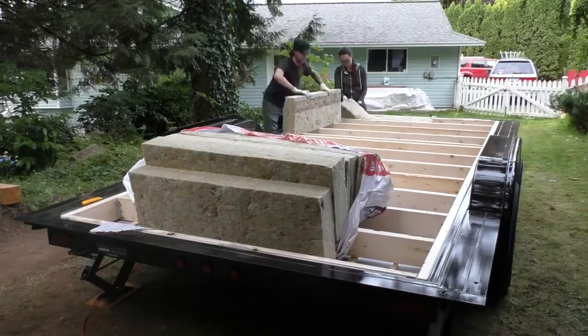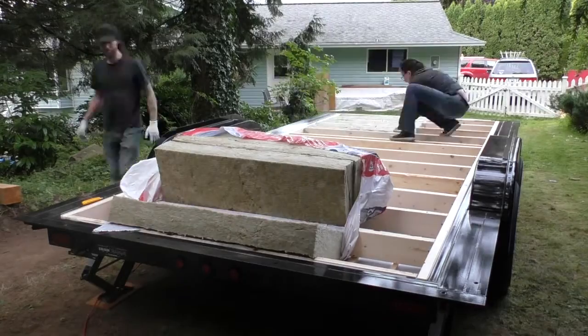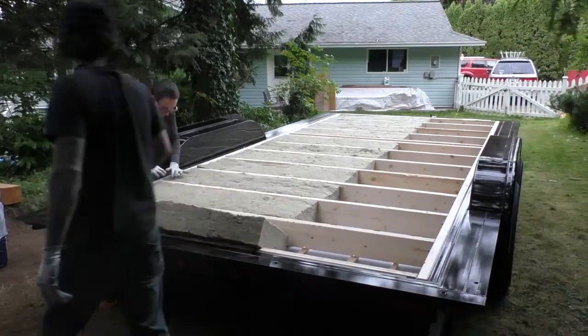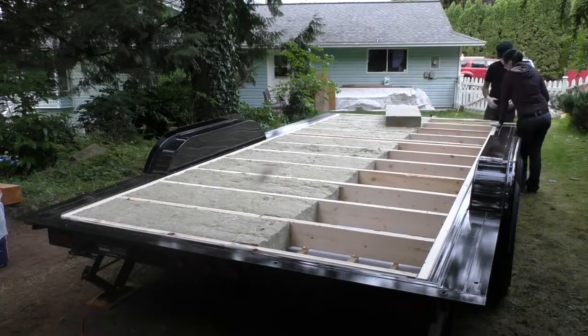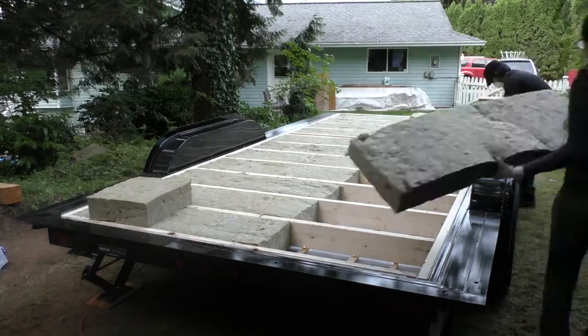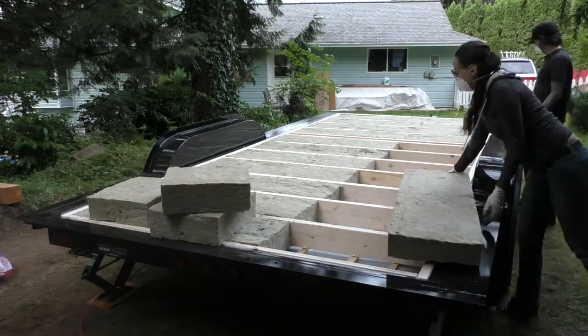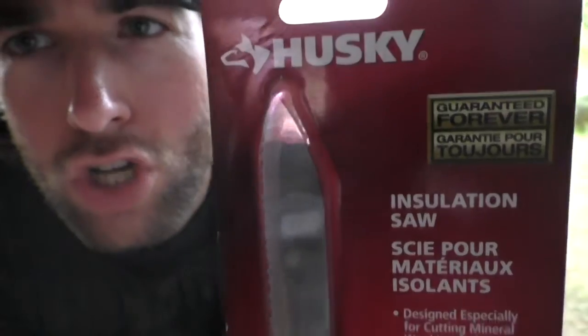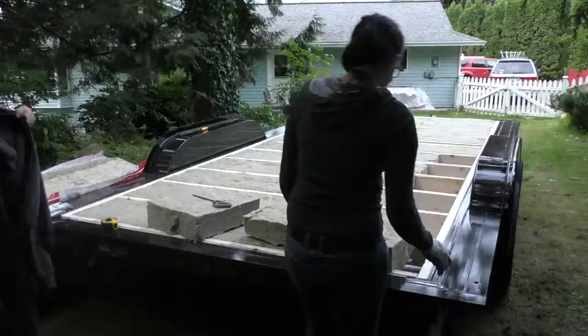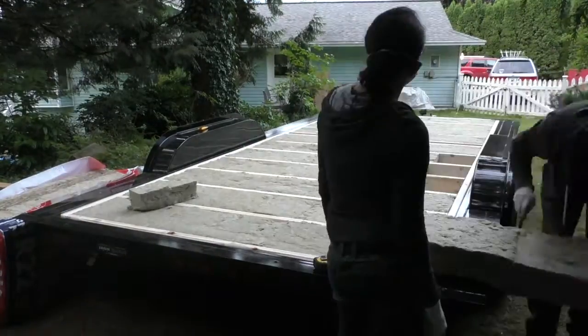With the floor joists installed, it was time to insulate. This process was quite easy since our floor joists were installed on 16-inch centers and insulation is manufactured to fit between them. We used RockWool R22 insulation for 2x6 joists. We had to cut them down to get the second piece to fit and used an insulation knife — basically a bread knife with a sword handle. We just needed to make sure the insulation was covering the whole area and not getting squished or folded. And that's it!